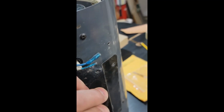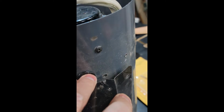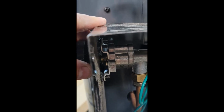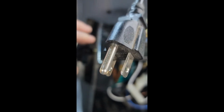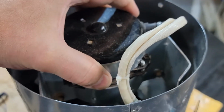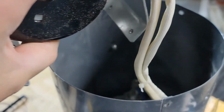So this screw, you can pull this down, and I see I already got that one pulled out there. On this side, you need an extension on your drill, and then you can get kind of up over that valve. You can see that light spot there. That's where that screw was, and you can pull that out with an extension on your drill bit. So now I pulled out these top 2 screws, and this assembly is going to be loose. I've pulled those 2 wires, got some slack in there, so now I can carefully pull this out.